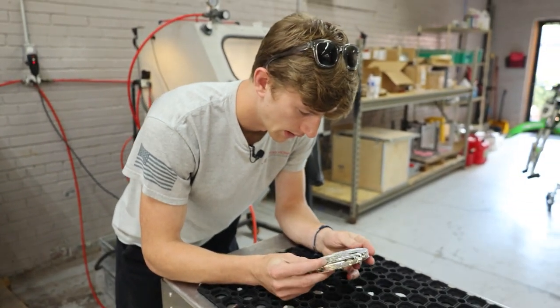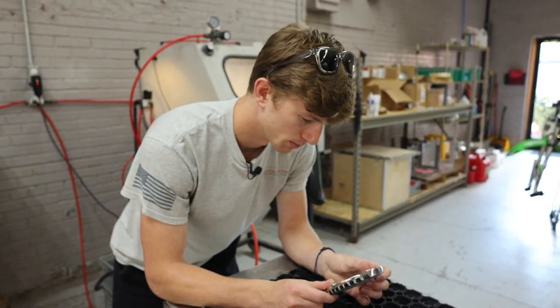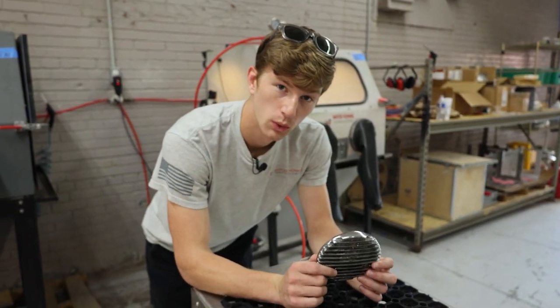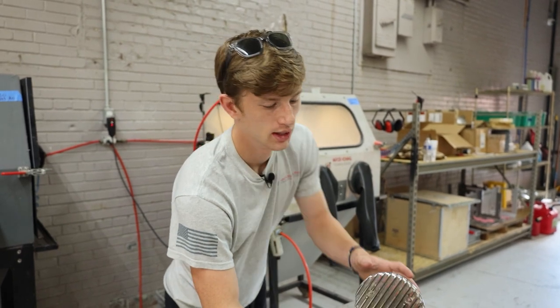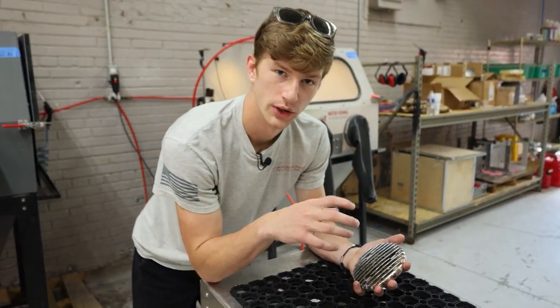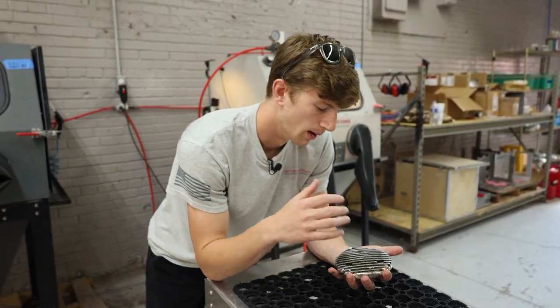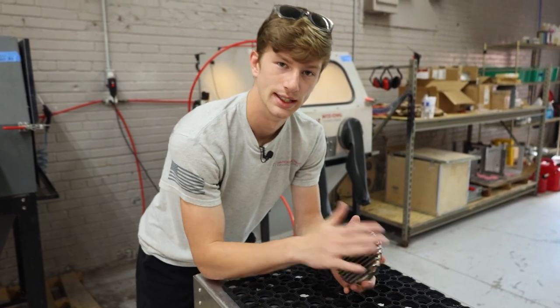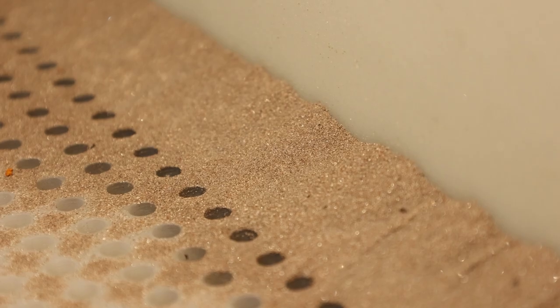So I vote we remove this and polish it back up to see how good we can make this part look. If you were wanting to re-chrome this after you do your aluminum oxide, that would be a good choice — especially if you want a different type of coating that needs to grab into the part really well. If you wanted a flat chrome finish, you could do glass bead and then chrome it. It just depends on what you want. We're using 120 aluminum oxide, which is more aggressive, so it should take this chrome right off.